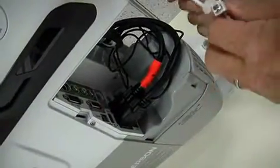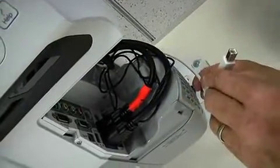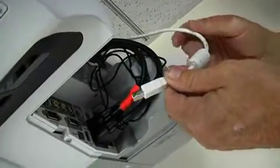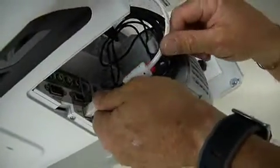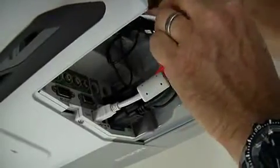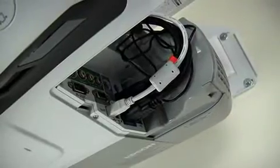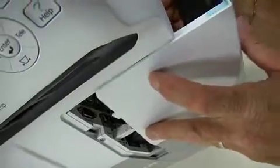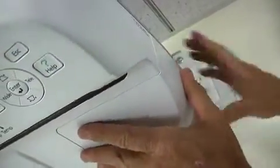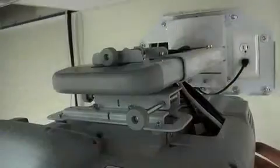Okay, and now the last connection is our USB, and we want to make sure that we put the USB B port in, which enables us to utilize the interactive pen on the A side into the laptop itself. So we insert our B, and we make sure our cables are nice and tucked, so then we could slide our finish cable portion cover like so. And we simply take our screwdriver and tighten up the screws. And then we have our side caps like this.